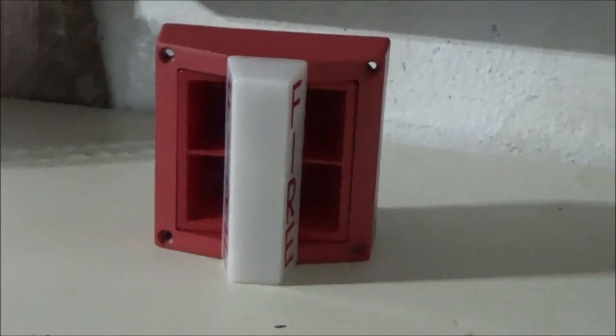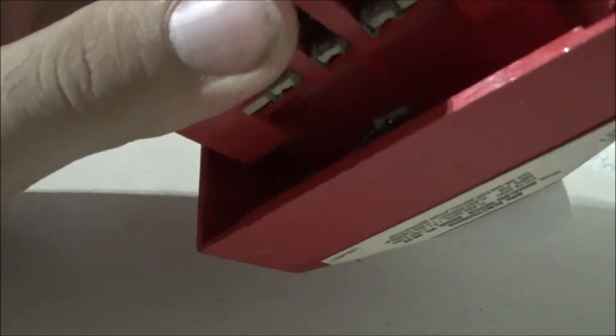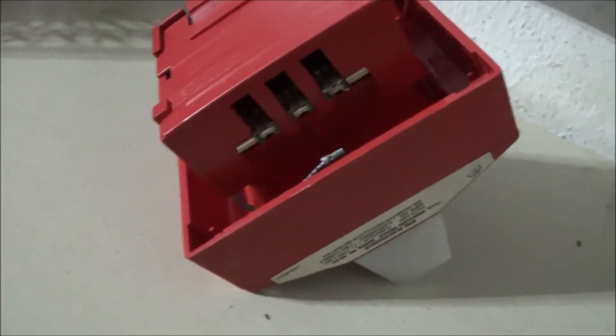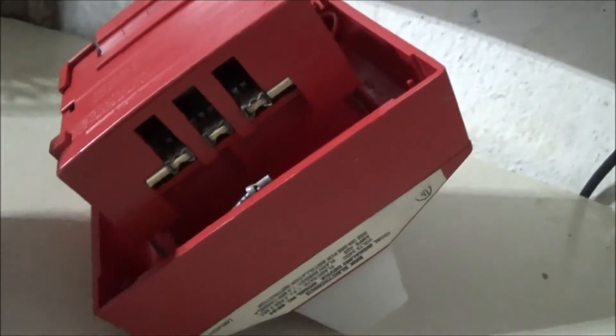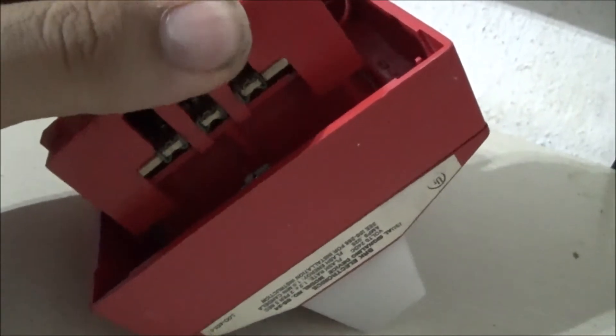I figured a way to go around it. What I did is take the soundboard apart — I'm not going to take it apart now, but you get the idea. What you do is scratch up one of the joints. There's the joint that goes together; you scratch that up completely. Then I get the clip from the other System Sensor MASS I have and put it to these. What this does is make it easier to change the tone. When it says 'break,' it means it's making no contact. So if you see where the tab doesn't break, you remove it and it gets you to that tone — plug it back in and you get the same tone. I did that so I can make this multi-tone and change it instead of being stuck to one tone forever.